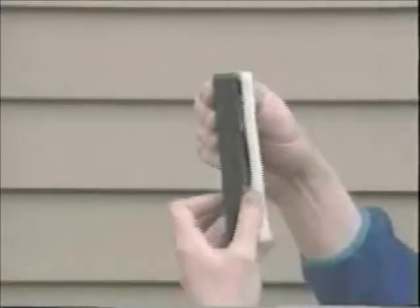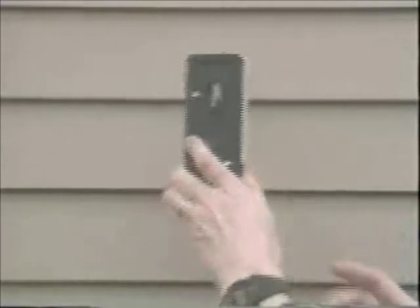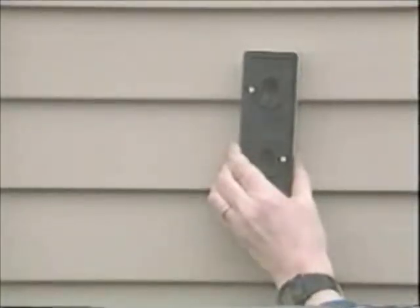When an awning is installed on an open flat wall like this, the optional hood system shown here is recommended. When installing the awning on siding, you can either use a 2x10 pressure treated board behind the installation, as shown here, or for a nicer looking installation, you can use spacers available from SunAir. See your manual for installation details.